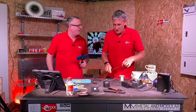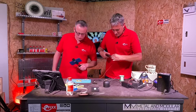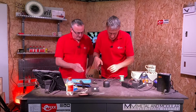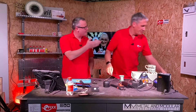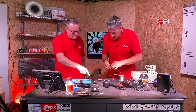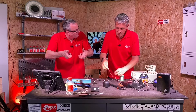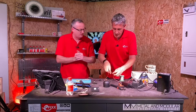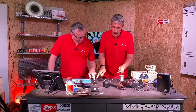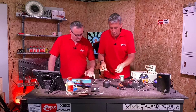Can Gordon liven this up? And we see that these LEDs illuminate. So lots of positives here - we like the fact that it got up to temperature 350 degrees very rapidly. Maybe we'd like to see a shroud, similar to what we'd see on GS38 test leads, where you're stopping yourself slipping towards the heated elements. And if I was doing it, I'd try and get a lighter silicone lead that's a bit more flexible and a bit longer actually.